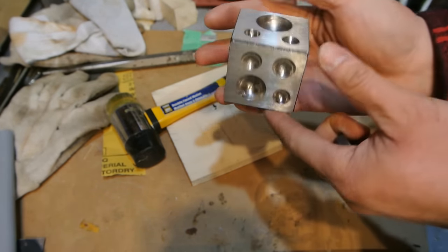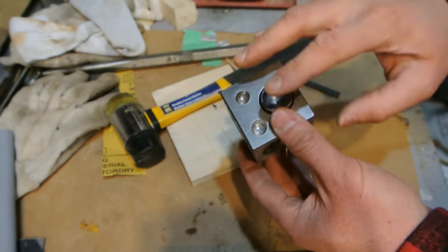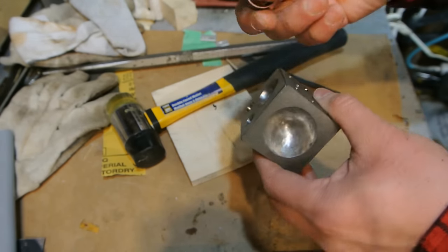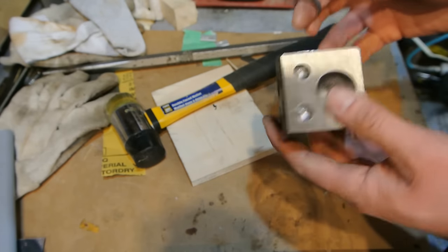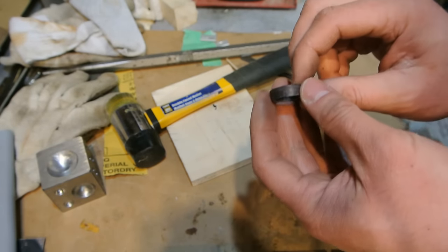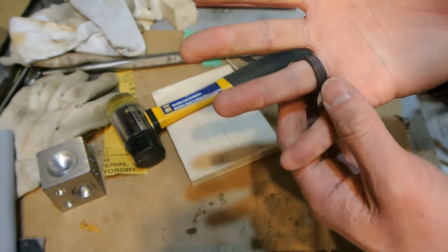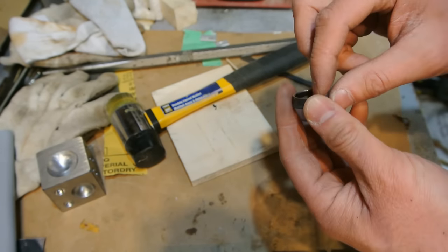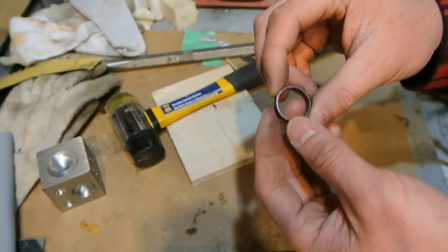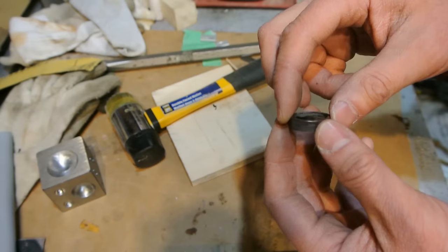And this is a doming block. The ring will sit in like that, and I'm going to put it in a vise and put pressure on it, and it'll push it inward and round it out. This is optional. If you have one, or if you buy one, I got this from China. It was pretty cheap. Or you could call this ring done and polish it and wear it. Sand it to take the edges off with some wet dry sandpaper or a sanding sponge. Okay, I'm going to keep working at it a bit, and then put it in the doming block and polish it.